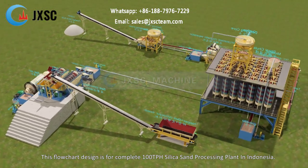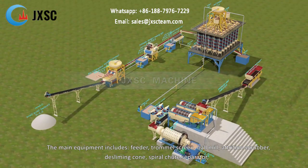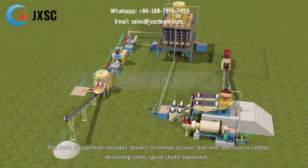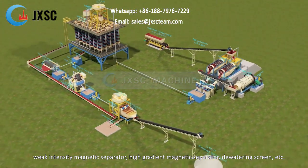This flowchart design is for a complete 100 TPH silica sand processing plant in Indonesia. The main equipment includes feeder, trommel screen, ball mill, attrition scrubber, desliming cone, spiral chute separator, weak intensity magnetic separator, high gradient magnetic separator, dewatering screen, etc.